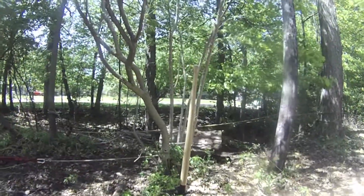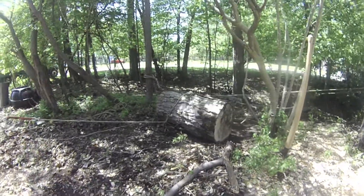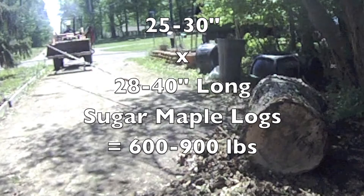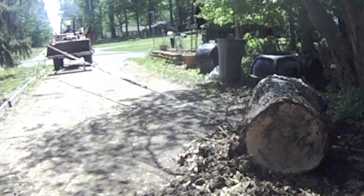This vertical Speedline easily allowed us to direct heavy logs away from a house, wires, and a steep hillside, avoiding negative blocking and almost all strain and impact on the rigged spar. With logs weighing in excess of 800-900 pounds, this was a great benefit.